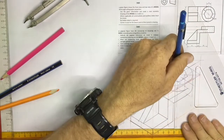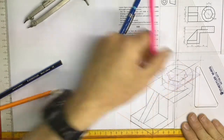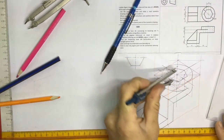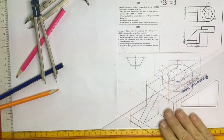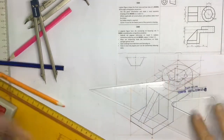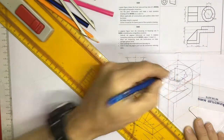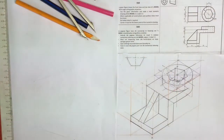It's a hexagonal hole that goes right the way through this thing. It should go down the 20 millimeters. Let's just draw a construction line coming down. Check that that 20 millimeters is not going to make me have to draw another little hexagon at the bottom. It will. Okay, so there we go, 20 millimeters down. I can draw a line coming down over there. All right, I need a line coming across because it's flat, bottom there. I need a line going at that angle over there. So what am I going to do? I'm going to take my set square, line it up on that line over there, drag it down to that point over there, take a line coming across over here, and then I'm going to drop a line coming down from the corner over there, and that is the hexagonal hole done. Right, that's finished.